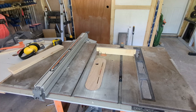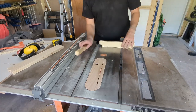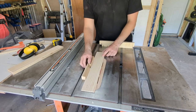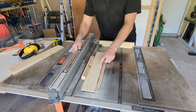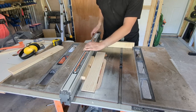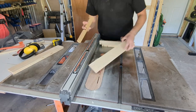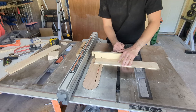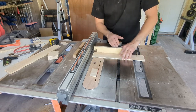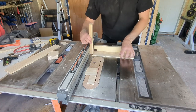With that done, it's time to cut these down to their final size. I'm going to use my fence as a stop block along with my miter gauge. In order to do that safely, we need a bit of a spacer. I'm not going to measure anything — I'm just going to toss our 3 inch blank against the saw blade, put the spacer beside it, and bring the fence up to that. Now we just square up one edge, bring the piece up to our stop block, and cut.